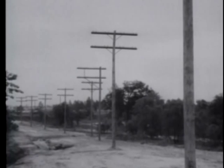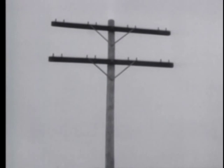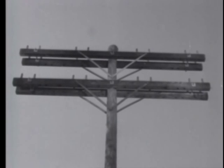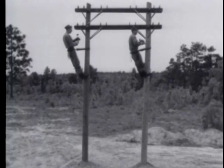You have seen many of the usual methods of erecting poles and attaching crossarms. Normally, you will use single crossarm construction. For additional strength, the double crossarm may be used for a dead-end pole or a corner pole. Or for additional strength for a corner that has a slight pull, a back brace is used. To bypass an obstruction such as a building, the sidearm construction is used. And for long spans and for stability of the line, the H fixture is used.